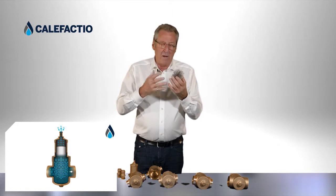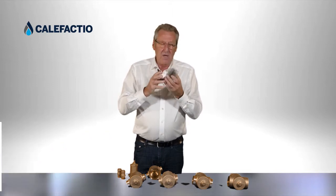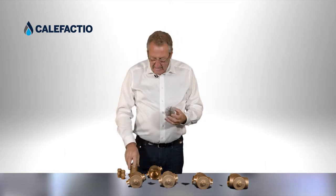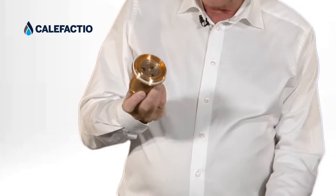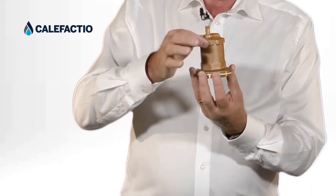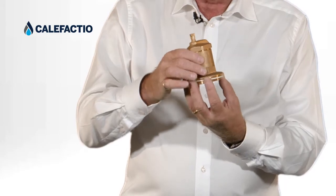And then there's going to be a third bubble, a fourth bubble. And when the bubble is big enough, its buoyancy is going to make that bubble come up to the surface. When it comes up to the surface, it's going to go through those three openings over here, go through the air vent, and the air is going to get out.